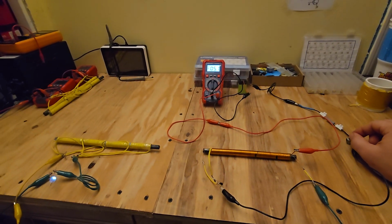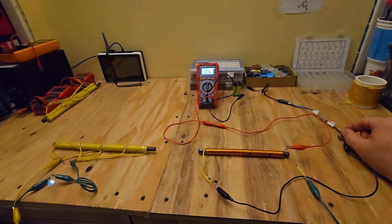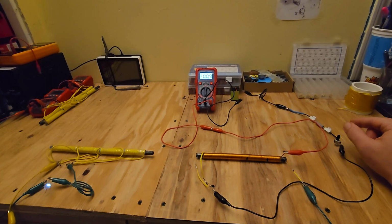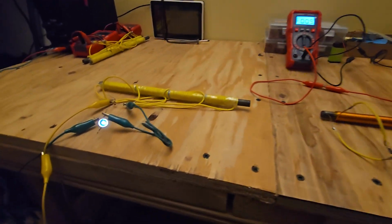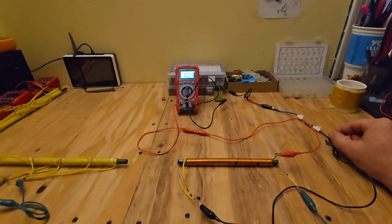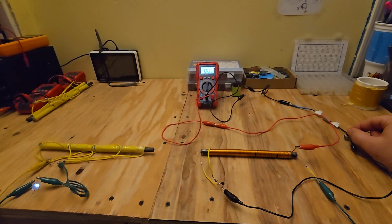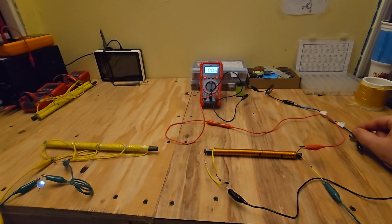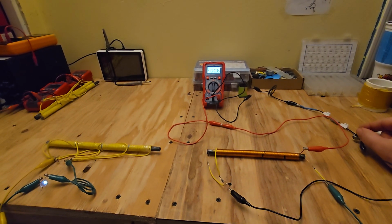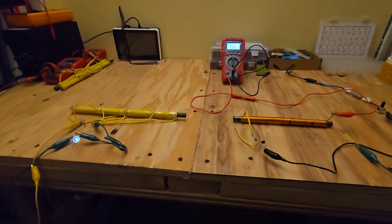So it is on, we are consuming 5 milliamps. But we don't want to be consuming 5 milliamps, that's kind of a waste. So I fine tune it with the potentiometer down to the point we're at 1 milliamp. Didn't really put a degradation on our wireless power output. And again, I want that a little lower. 0.07. I think the best you can get it is 0.003. At least with this transistor. And still maintain the good wireless power output. Yeah, okay, so that's the best I think I can get it.